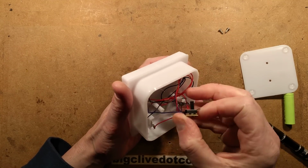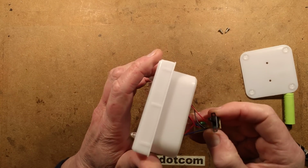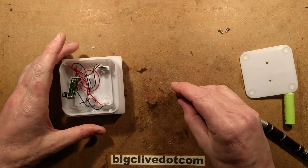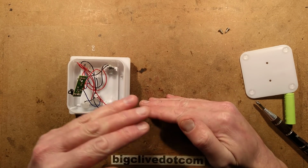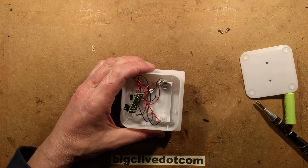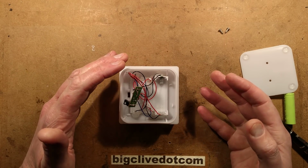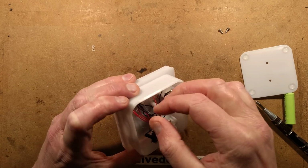You may notice as I speak, every time I speak there's a slight buzzing noise, and when I stop speaking, the buzzing stops. That's because this phone uses what they call a noise gate. A noise gate is used in the audio industry to cut out background noise like hiss. Basically speaking, below a certain amplitude of sound level, it will go into silence and it will gate that off. So that's what this phone does, and it sounds actually okay, except the transformer in the soldering iron, which I've got on next to me, every time I speak you can hear the hum, but when I stop speaking, as with any other background noise, you'll suddenly hear silence. It's quite an interesting effect. It works quite well. I'm not sure it's a great effect.